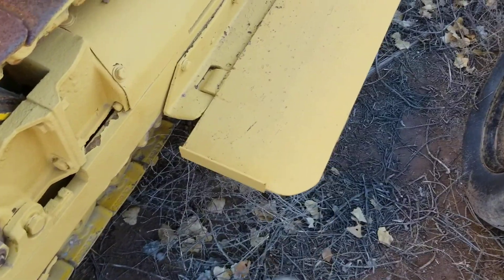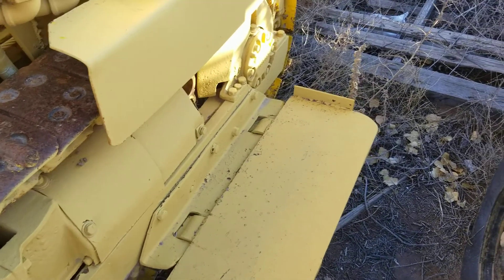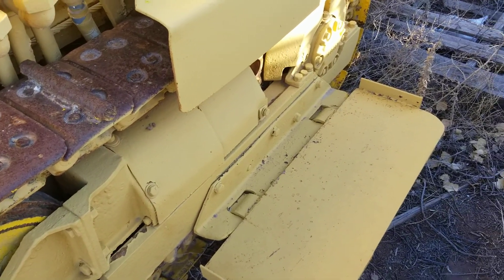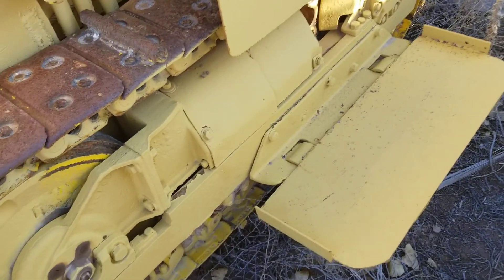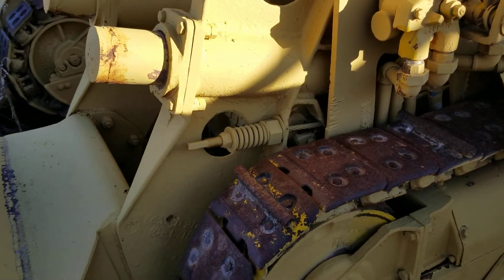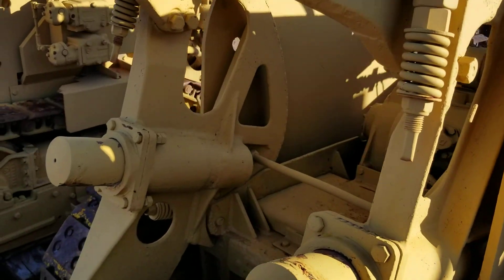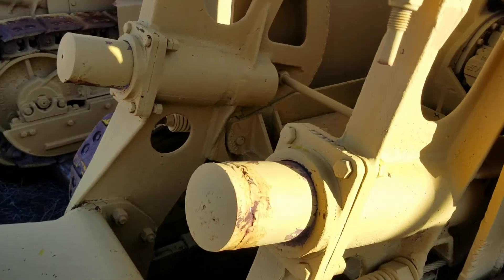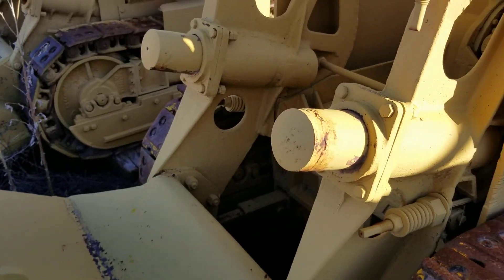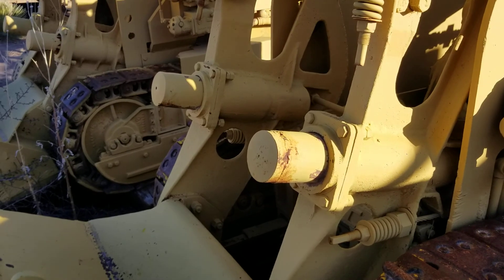You see it folds — it's intended to fold to cage the machine, or if the operator wants to run it off the side, which I know for some applications is the way you've got to do it. They've also got shock absorbers — big shock absorbers — and I believe those are to absorb the impact of the bucket throwing all the way back.